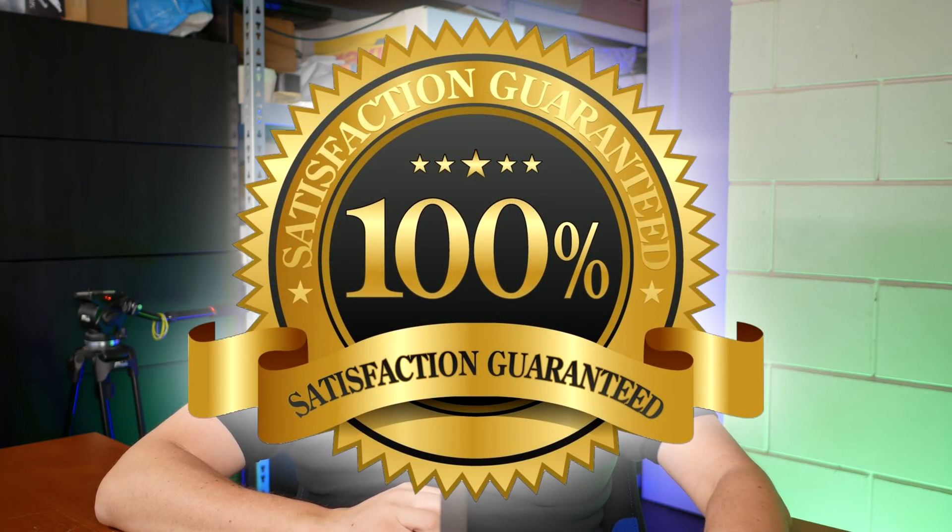Testing done. I think these tests were 100% successful, and this proves that, especially with the very high PWM frequency, QuinnLED is very suitable to use with video lighting. That makes the whole solution a lot more versatile. My latest prototypes — it's actually revision 4, this is a revision 2 — are in the post from China, and I hope they arrive soon.